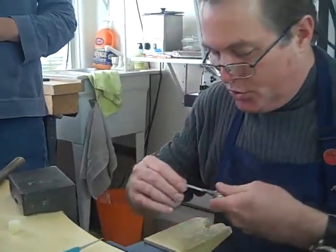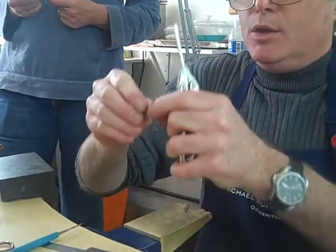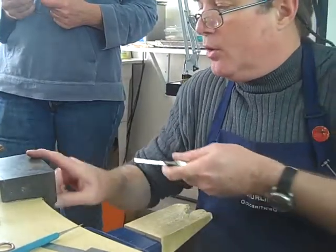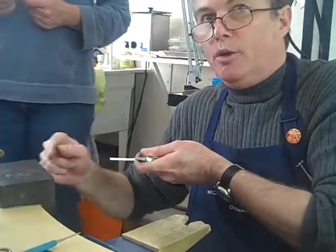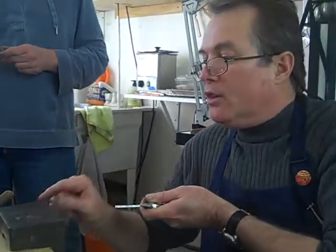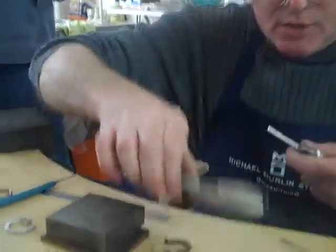I'm just going to grab it at the two ends. And as long as we twist a section in between, the twist will start in the middle and work to each end. But the way of twisting wire where you hook one end on something and twist with a drill — it's tighter here or tighter there, one way or the other, it's not evenly twisting. So trying to get the very last part even, usually we'd want to make the twist originate in the middle and spread to the outside.